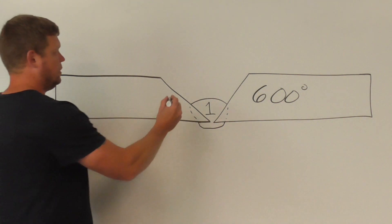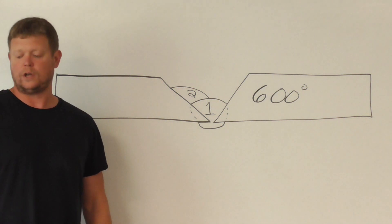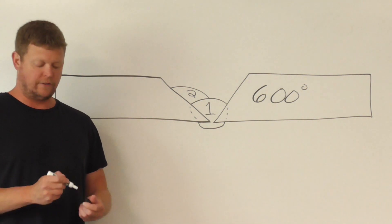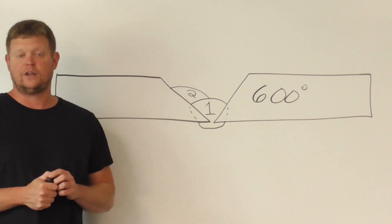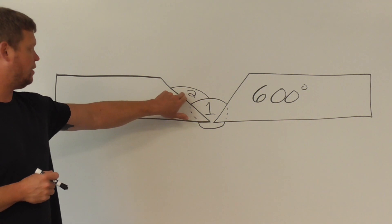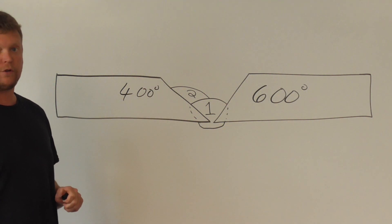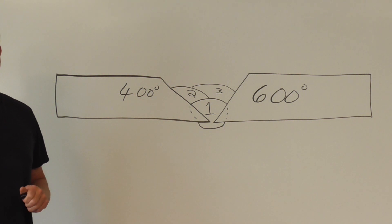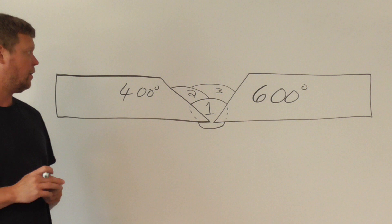Your next pass is probably going to go like this — that's pass two. Again you have to hit it with the digital thermometer or the temp stick. A temp stick basically looks like a crayon, and if it melts when you touch it, you're exceeding the temperature assigned to that stick. So if it's a 300-degree temp stick and it melts, you have to wait until it doesn't melt. With a digital thermometer you just shoot it with the gun and it tells you. So you do pass two, the thermometer says 400 degrees — you have to wait until it gets below 300 before you put pass three in. Also, don't quench it — that messes up the microstructure too. You've just got to let it air cool.